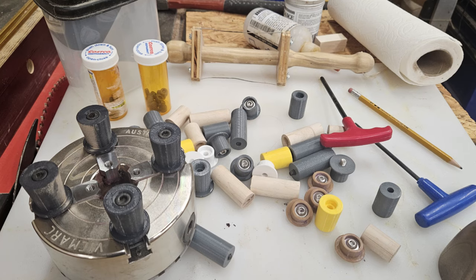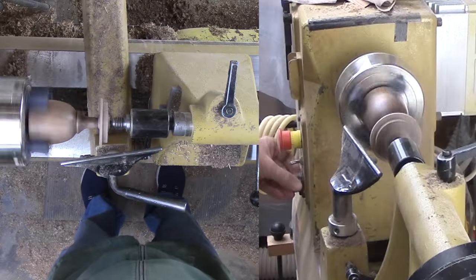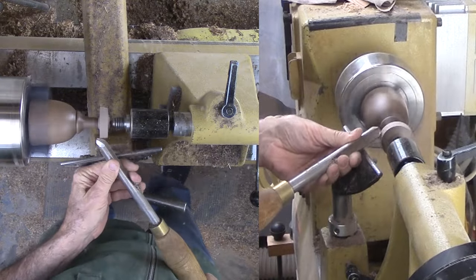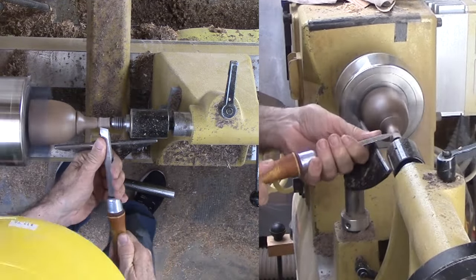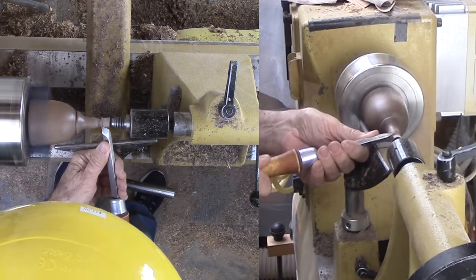I have fiddled a lot with various ways to hold a partially completed project while finishing the extreme end. Ever since I first used these on my square box, I have developed a lot of variations of the pin jaws — they are good for light duty work. The bolt provides the strength of steel and attachment to the chuck jaw base. While I 3D print mine, they are also easily turned from wood. This set has a platform the goblet lip can sit on and a reverse taper to accommodate the rounded goblet bowl — without the reverse taper, the goblet would not stay put. With the goblet mounted in the pin jaws and centered by the original divot with the live center, it does not take much to waste off the old tenon, then shape the remaining bottom and drill for the mortise. Then touch up the sanding and finishing.